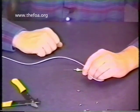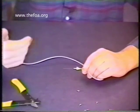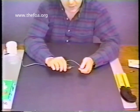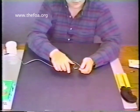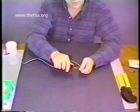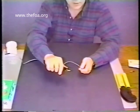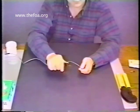The next stage is to take an alcohol wipe and wash the fiber down with the alcohol to remove any leftover debris from the glass itself. Before we go to the next stage, I want to reiterate one point: the proper stripping motion when stripping the buffer off the glass. Number one, keep the strip tool at a slight angle so that the buffer does not bend down and away and possibly break during stripping — the proper clamping direction is on a slight angle. Number two, pull straight away and do not flick your wrist. This will also cause the glass to break. Pull straight away and use your elbow as the moving part of your arm. Do not use your wrist at all.